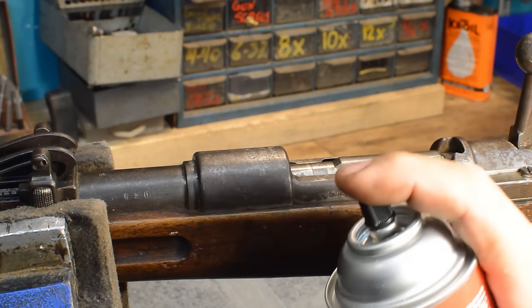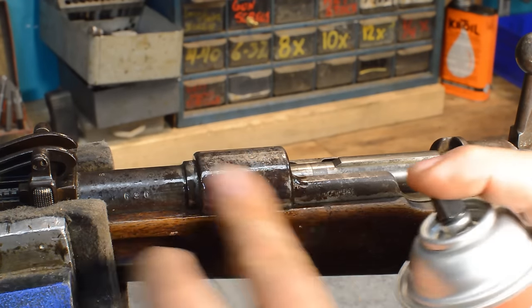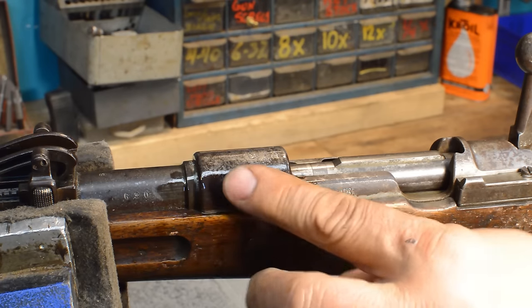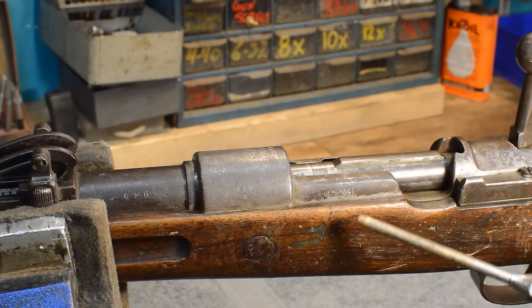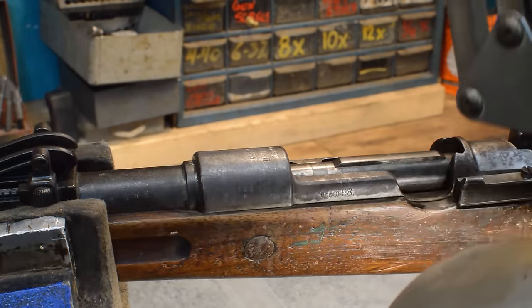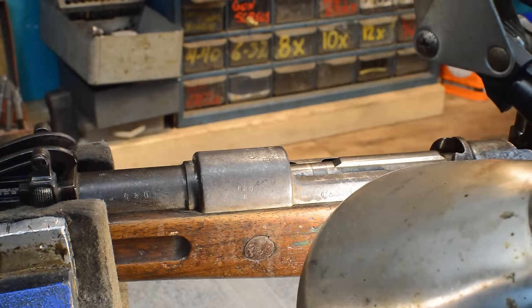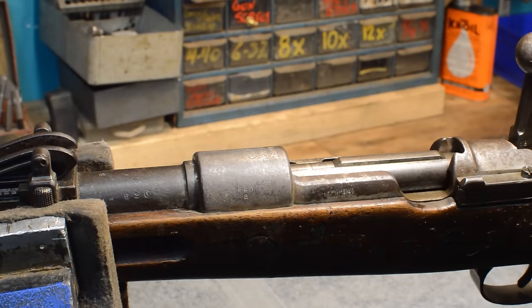I'm showing you that if you take the oil off of this rust and dry it out — I've already checked to make sure this particular brake cleaner doesn't mess the varnish up on this gun — we blow that thing dry and that is rust. I don't care what you call it; that whole thing right there is frosty. This should be in the bright. When we're doing a conservation, we're going to stop that. Are we going to polish this receiver ring back down to the bright? Not really. But what we're doing on a conservation is stopping all of this decay.